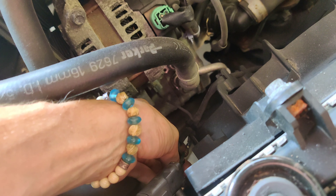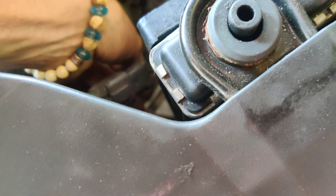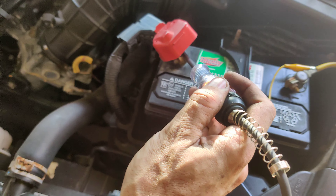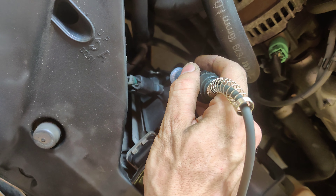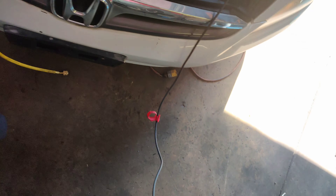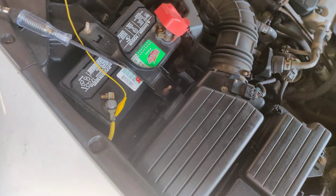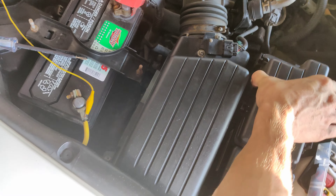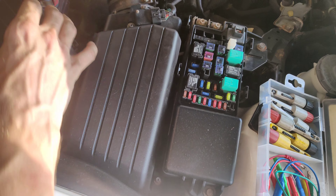I'm guessing that's how they normally are, or somebody broke the connector. We'll see if we have power going to the clutch — it's gonna be really easy to hook my test light up now. I'm connecting my test light to battery ground. You can see the light's on. We have no power here. We can hook up a scan tool or go to the fuse box — maybe it's shorted out from that being exposed with just the tape on it.